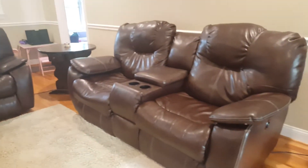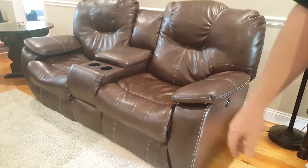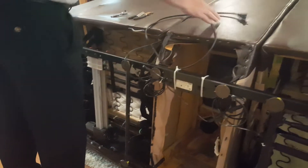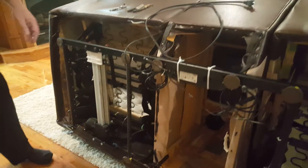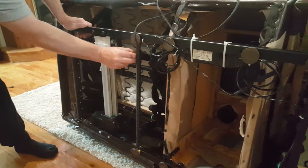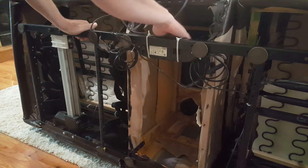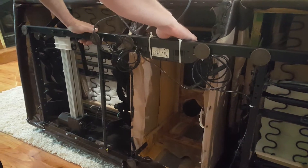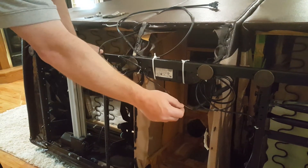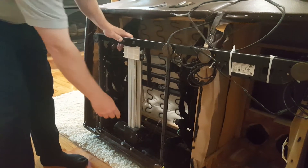This is the fourth failure now, and I'm going to go into how to take this thing apart. We've unplugged the couch and tipped it over, and this is the actuator we're going to be removing. The power comes up to this line right here, comes through, and here's the connector. It's being powered from this box here where the main power comes in. When you unpower it you can either disconnect it at this connector or disconnect it right on the actuator itself.